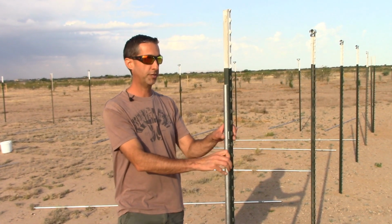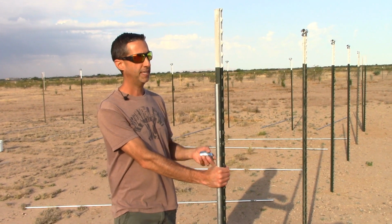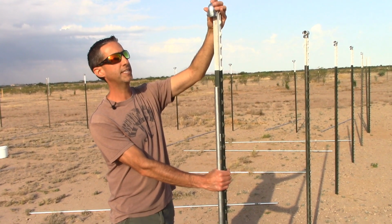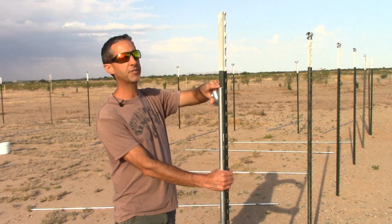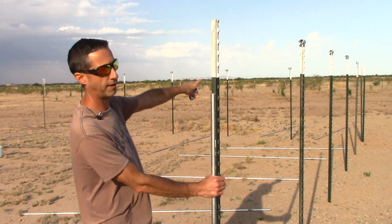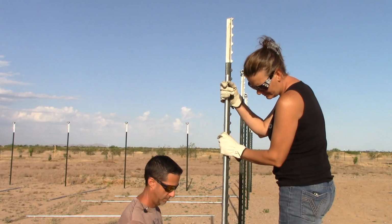We're going to use some 3/4 inch EMT that we have cut to 5 feet to go ahead and reinforce this side. We'll have another piece of EMT that's basically up here with the elbow, and we do 2 separate pieces so we can adjust this up or down based on how the pipe looks as we go across. So we do cut it in 2 pieces on purpose. We're going to go ahead and get these reinforcements attached. We have one to put here, one in our corner, and one on the far side as well at the end of this run.